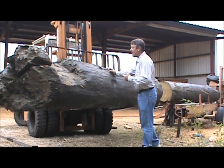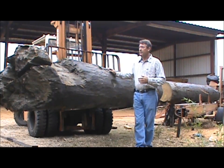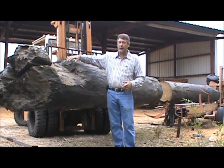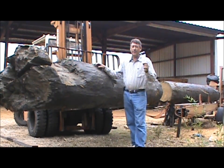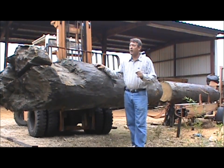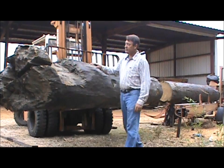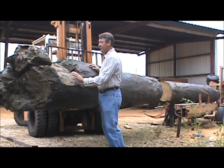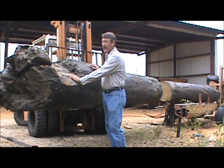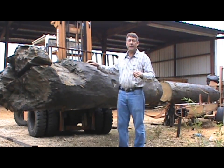It was about 30 feet long and I've cut it in two — two 14-foot pieces. On the big end it's 29 inches, and in the center it's 23 inches. It's all hard, but maybe about an inch on the sap. It's got some wooden pins that are broke off and weathered a little bit, and it's got a couple of areas where they notched about five or six inches, where they apparently mounted some uprights or other pieces of the dam. These two pieces scaled out at 740 board feet.